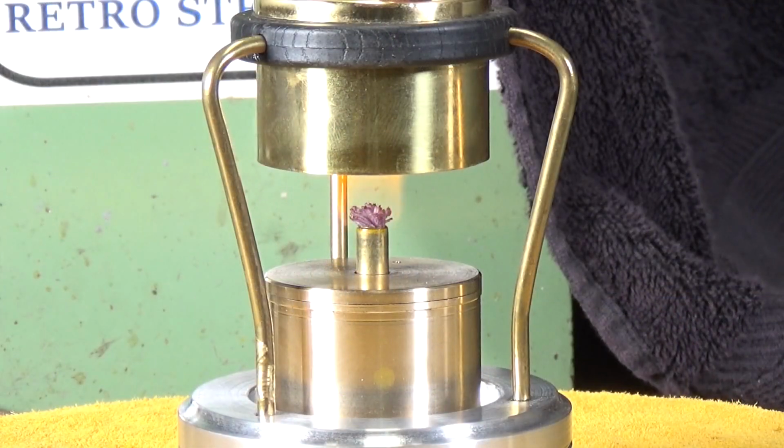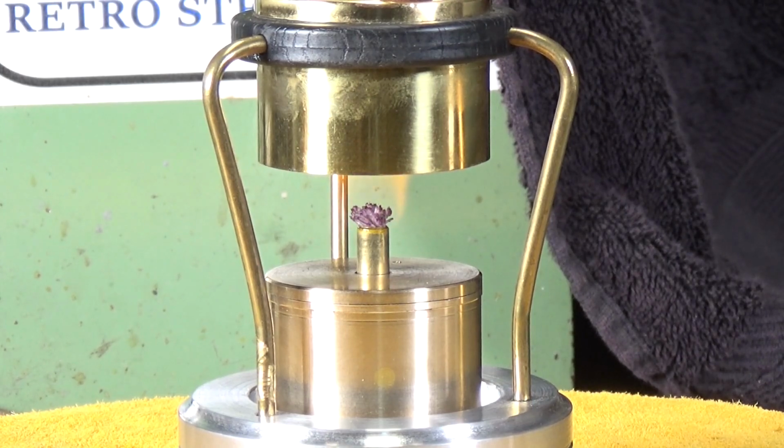So I thought you just might like to see it in sort of close up. Now I intentionally made the wick tube adjustable. There's a little collar with a grub screw so I can raise and lower the wick tube, because I wasn't quite sure what sort of height I really needed for the flame. So I've played around with it, and I think I've got it just about right. So yeah, let's let it heat up, and we'll see it run.